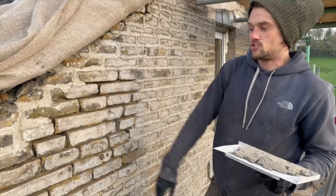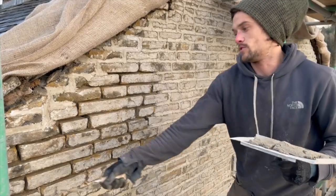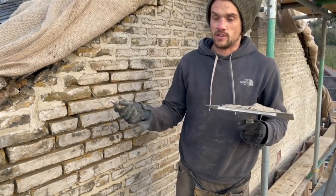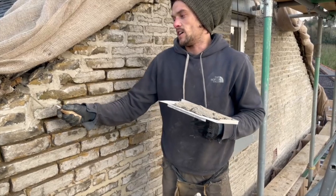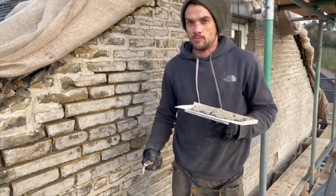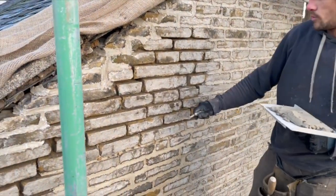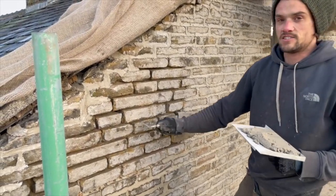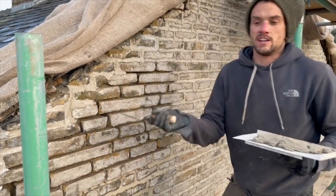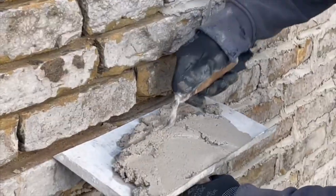Because this wall is laden with water, we're not soaking the joints on this section. Normally if the wall wasn't laden with water we'd soak all the joints first - that allows the mortar a slower curing process. With lime mortar you don't want it going off too quickly because it just crumbles. The average cure time on lime mortar is about 90 days, but after that it just gets harder and harder and better with time. For the back-pointing section, all we're focusing on is getting mortar into the joint as tight to the back as we can - if there are any air pockets behind the mortar, frost and water can get in and blow the mortar.